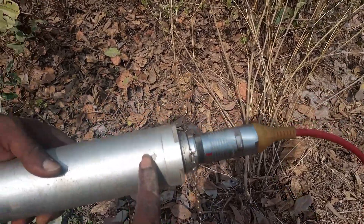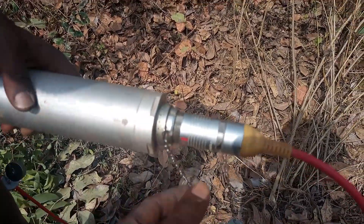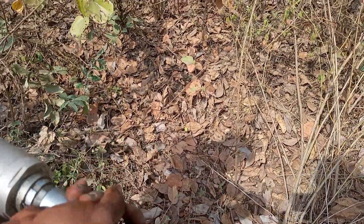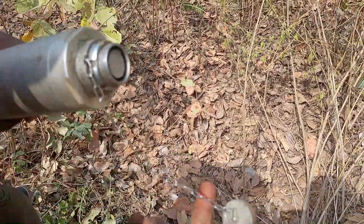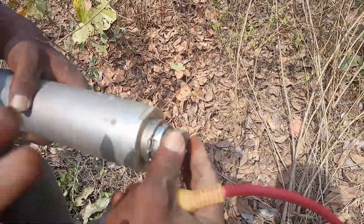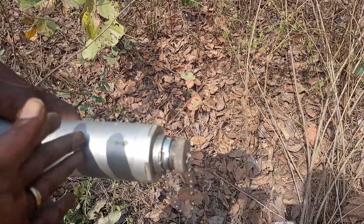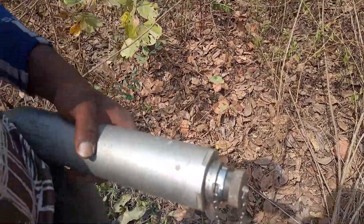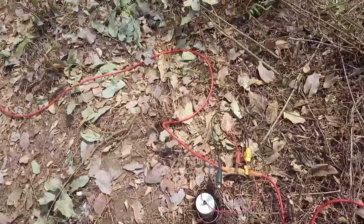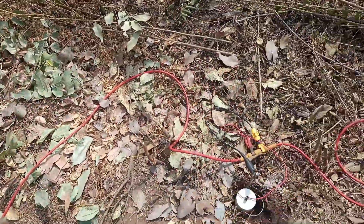Assuming your survey stops here and you are looking at maybe 120 meters length, you can lock up here so nothing goes beyond. The more electrodes you add, the more of this cable leader you require. For every 12 electrodes, one cable leader comes in, depending on the configuration. The spacing here is in centimeters and it continues that way.